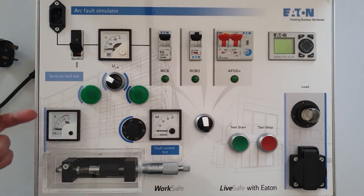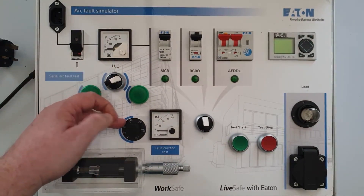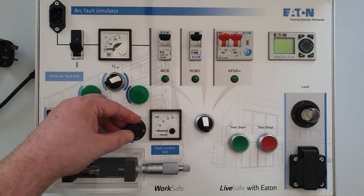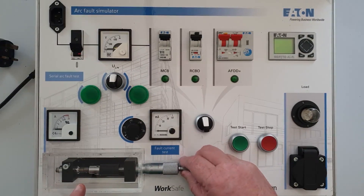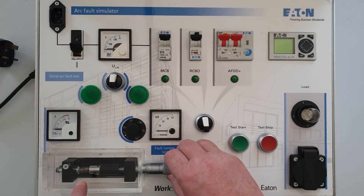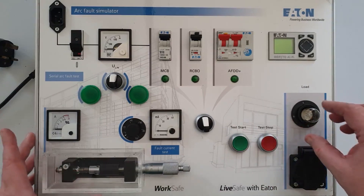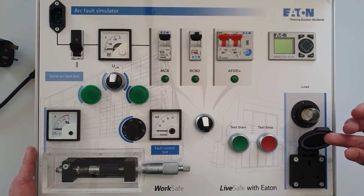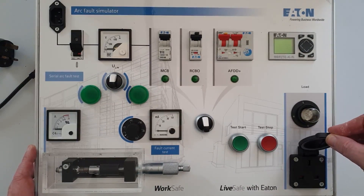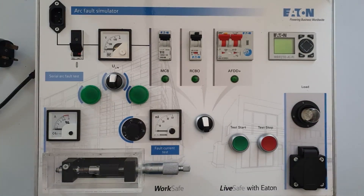This selector switch switches between the ArcFault test or over to this direction for a leakage test to verify the disconnection of the leakage settings. When we do an ArcFault test, we have a little contact which just closes the gap and creates an arc. Straight out of the kit, we can actually see arcs because we have a load here — this little lamp. But we also have this socket where we can introduce a much larger load. This helps us understand where AFDDs are really needed, and what kind of equipment like this lamp the AFDD isn't really going to do any benefit for. So let's connect this in and see how it plays.